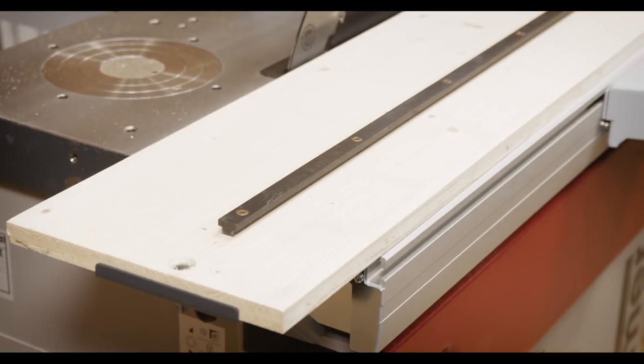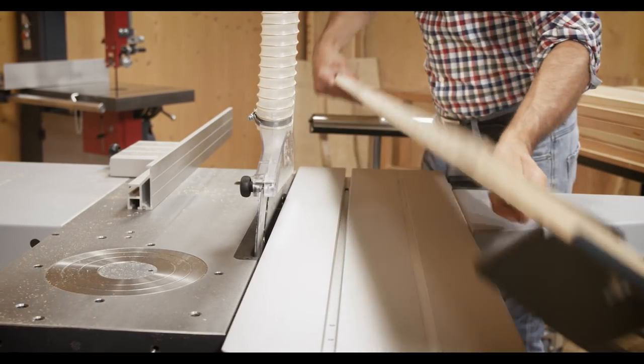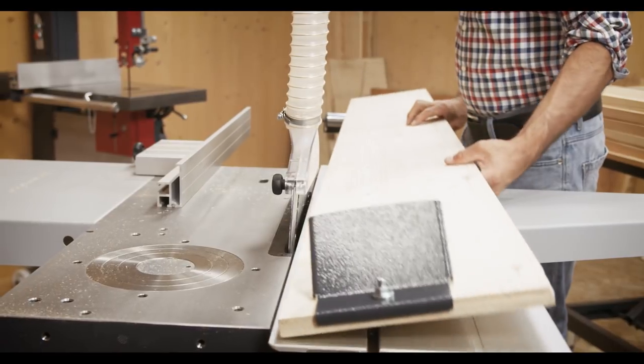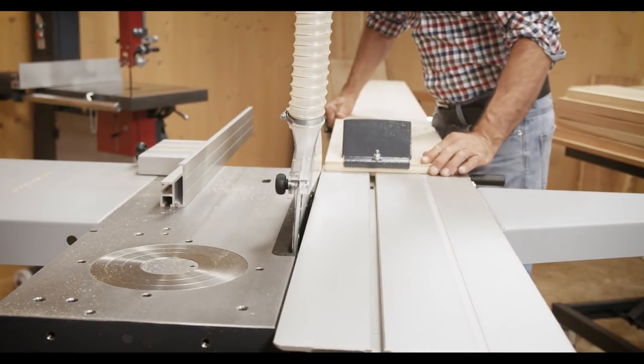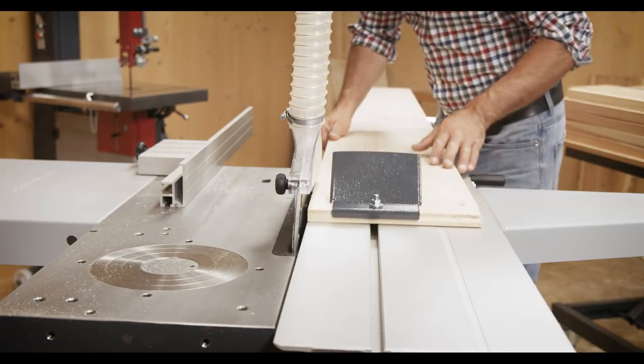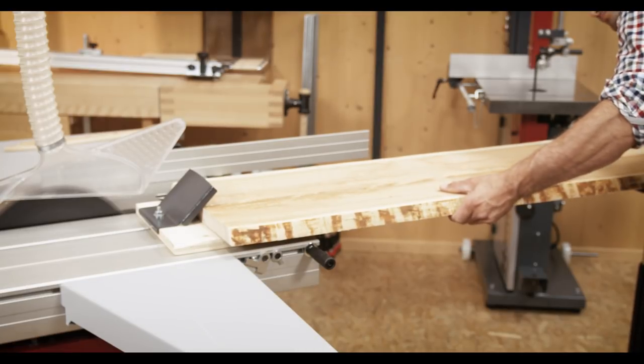And another hammer expert's tip: workpieces up to 3 meters long can be processed with a trimming stop. The bar runs on a T-slot at the sliding table, so the compact hammer circular saw is optimally equipped even for big projects.